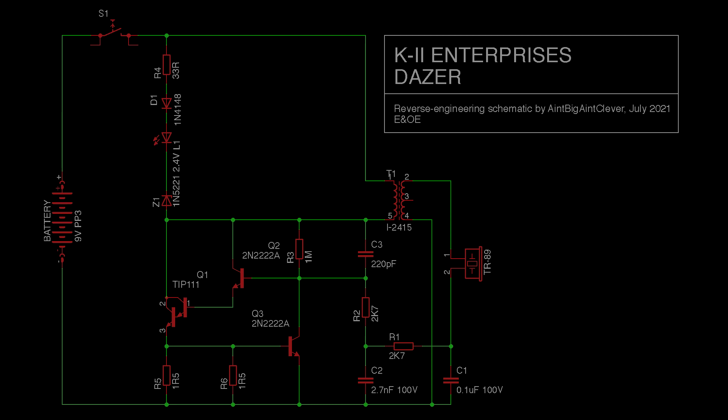The resistors and the capacitors will adjust the frequency of that. We'll find out what the frequency is in just a moment. This runs as an oscillator with Q1 effectively, apart from R5 and R6, effectively shorting its supply on and off. As it's bringing that input voltage up and down, most of that supply is actually coming through the transformer. And because that's going through the transformer, it's setting up an oscillation. That's driving the transducer, which also has a relatively large capacitor in there as well, putting its own two-penneth in.